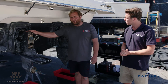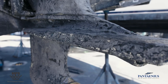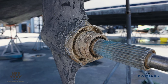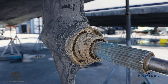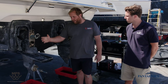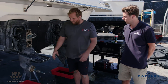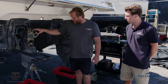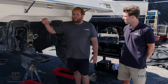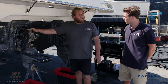Well, over a shaft drive boat, or a boat where its mechanical components are inside the vessel and aren't contacting salt water — being that these are made of aluminium, they are a pricey component. Certainly it is to do with the aluminium anti-foul that they have to use. You can't use copper-based anti-fouls, as it will react with the aluminium. The aluminium anti-foul, which is a hard-based anti-foul, doesn't work as well as the hull anti-foul. Any growth can inhibit any of these components and cause damage, which a lot of it's not insurable. So it's good to have the boat lifted, have it cleaned — at least just cleaned, not so much serviced — and then reapply the anti-foul in certain areas.